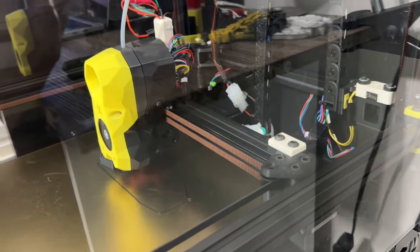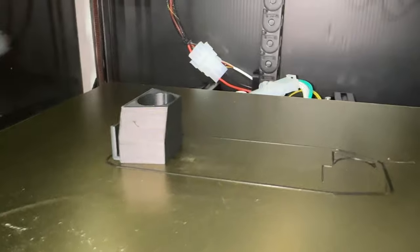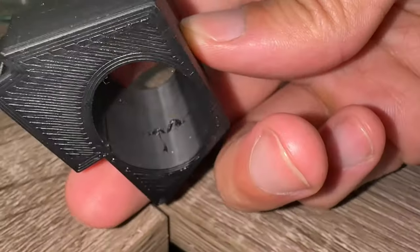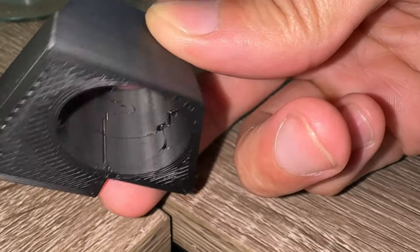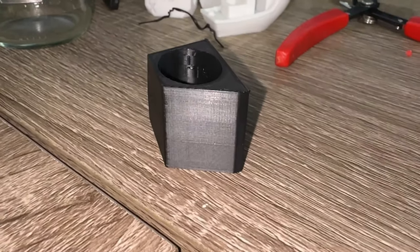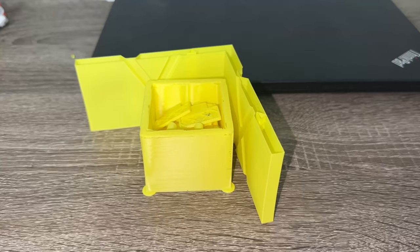Unless you wipe the nozzle, any blobs will make the transition more obvious. Other than that, it's not too noticeable unless you look closely. Coming from a really old printer, I think it's awesome we even have this option. I know there are more fancy filament runout solutions, but that's low priority for me since I'm usually around while printing.